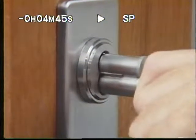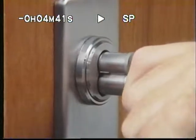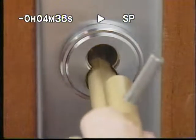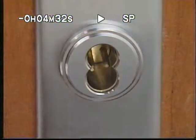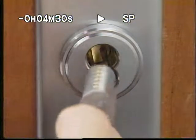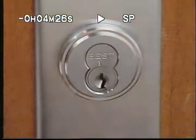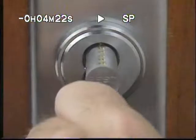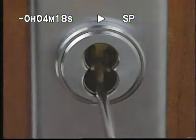If you experience any difficulty inserting the core into the housing, the throw pins may have rotated so that they are not in alignment with the core throw pin holes. To correct this, rotate the throw pins to the proper alignment with a mortise cylinder wrench or a flat-bladed screwdriver, and then check for proper lock timing. If this doesn't correct the problem, check to see if the throw pins in the core housing are sagging, and if they are, pry the throw pins to their proper position.